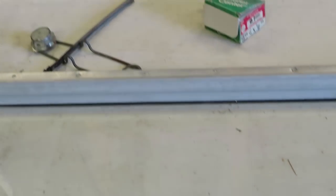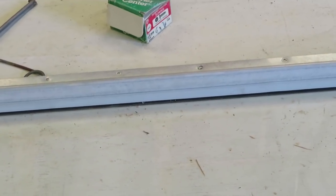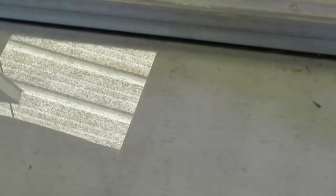With these same windows, there's also a glaze seal — glazing is anything, whether it's metal putty, goop, or solid stuff that holds glass in. Robert sells that and it worked out pretty easy. When I put the new piece of glass in, I ordered some from Robert and it worked great. He uses the black butyl on the other side, just like in the other videos with solid pane windows — it's less than half an inch, about three-eighths or five-sixteenths of an inch thick.